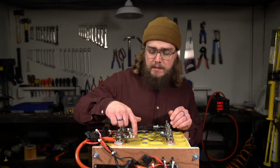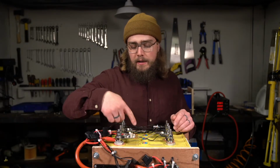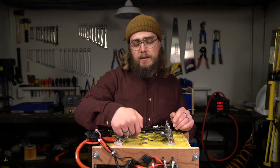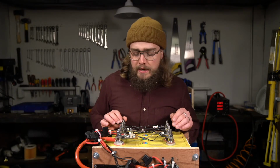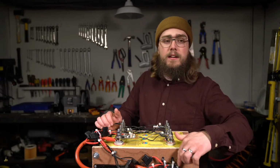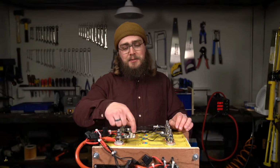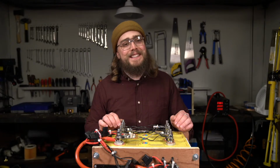it uses these outlets on the sides here to manage the relay, and it does it all by the voltage that it sends to these different ports where the cables are coming in. So if there's electricity there, say 12 volts, then it knows to tell the relay to open or close. And I think on the side of the relay you have the positive and the negative cable right next to each other, and I think I just touched them the wrong way around, wasn't precise enough, and just saw smoke coming out of the top of the board here. At that point I was like, yep, something is fried, it definitely shouldn't be smoking.